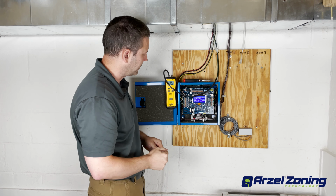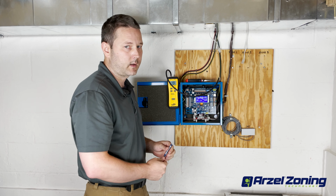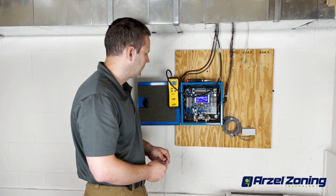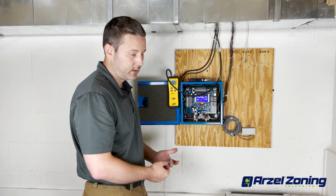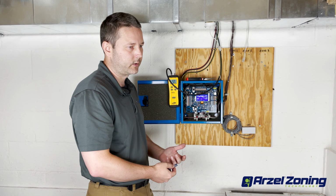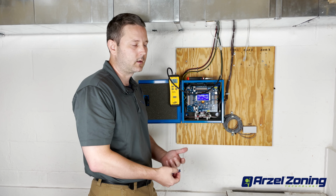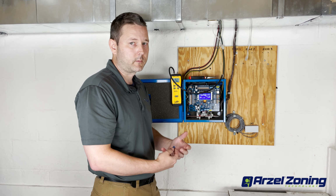Now with our fan call disconnected at zone 1, we're getting 4 or 5 inches. We're going to give that a couple of minutes here just to see if that pressure builds up. But the pump getting fairly loud indicates it's not able to actually reach its pressure. It's kind of unloaded. The pump is going to be at its quietest when it's able to reach full load, but we have a leak somewhere that we're trying to find. The pump hasn't been able to reach full load, and that's why we've got the noise from it that we do.